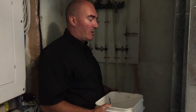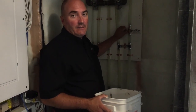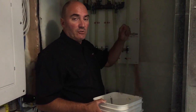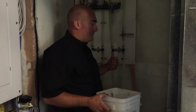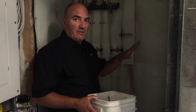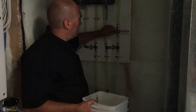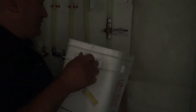Hi guys, back again — Pace at our mark here. We're in the basement. We've turned this valve off, went outside and found the exterior shut-off valve and turned that. We took the vacuum breaker off and shook that out, so we drained it. Everything's good. Now we're back down here. What we have to do is drain — there's a tiny little valve above the shut-off valve that we need to drain — the remaining water out of this line that runs to the exterior of the home. How you do that is grab a bucket, because it's going to be all over the floor.